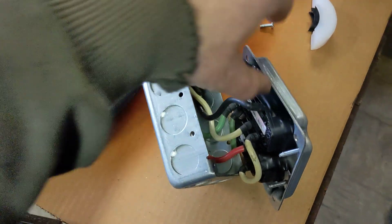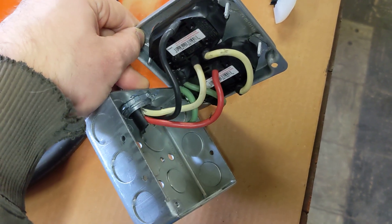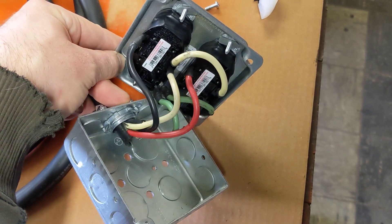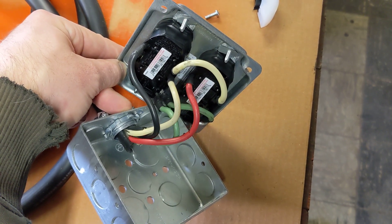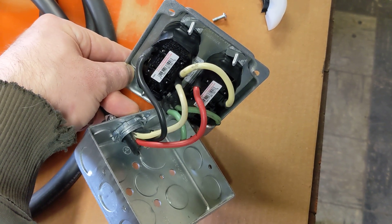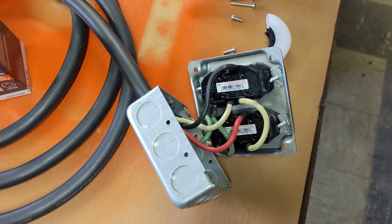How do you accomplish that? You have four-conductor wire: black, white, green, and red. Green is your ground — tie that together across your outlets. White is your neutral — tie that together as well. Then you power each outlet with one hot wire: black on one, red on the other. Get all this wired up and it'll be ready to plug into the generator.